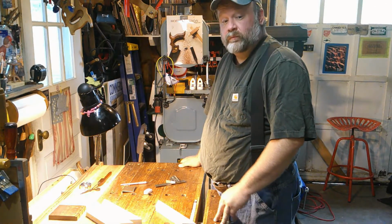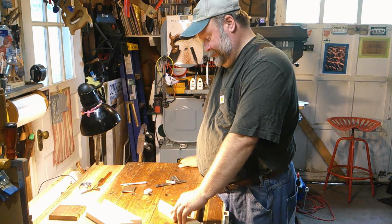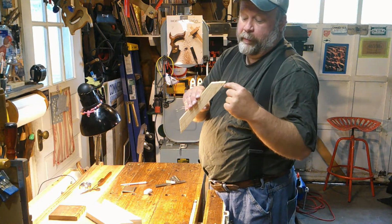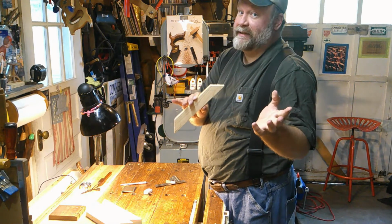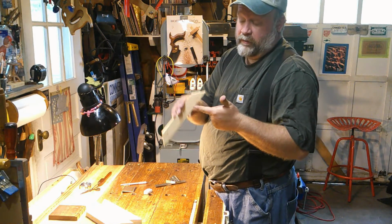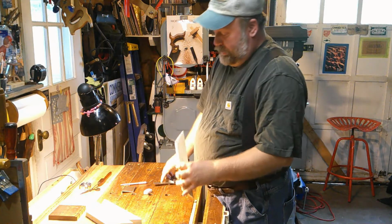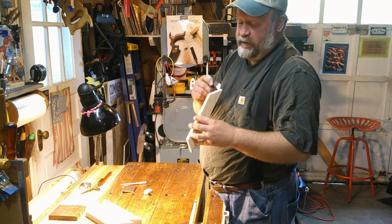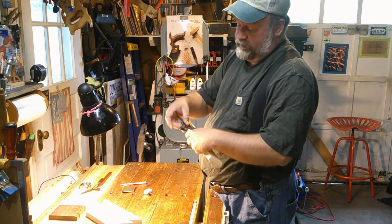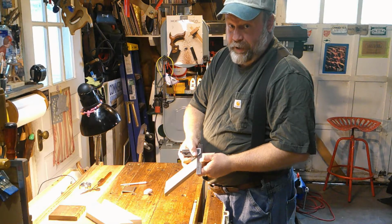Alright. We'll now lay out the dovetail part of this dovetail. One side of the dovetail is basically already done, as the angle's up, that side of the dovetail, that's it. So what we need to do now is cut this side in and a shoulder. It runs along underneath either the leg or the top. This will automatically be a 45 degree because of that. If you were to take your square and make the opposite of this, all you're going to do is make a vertical line, which is fine.